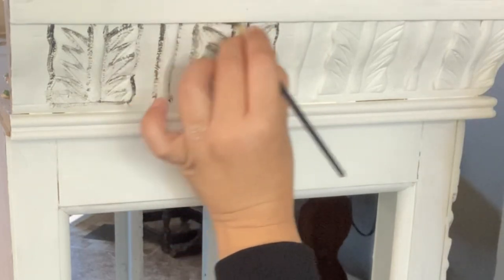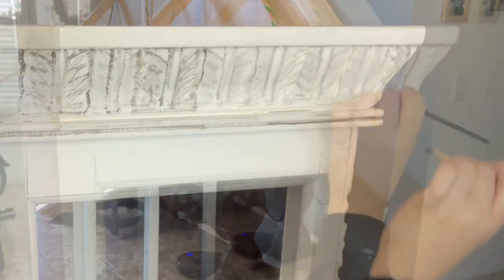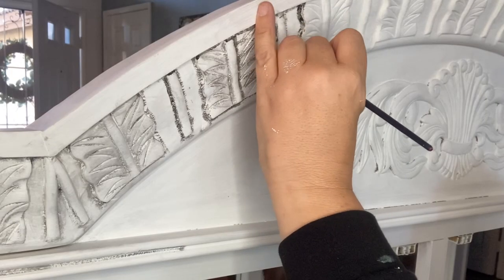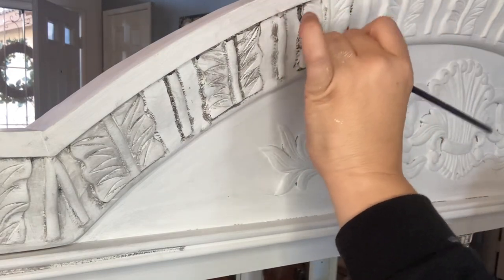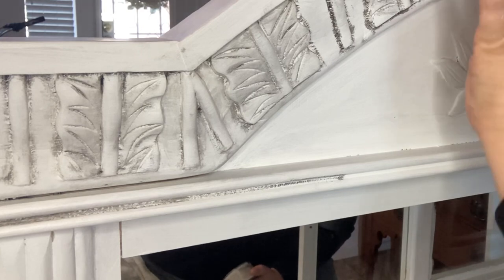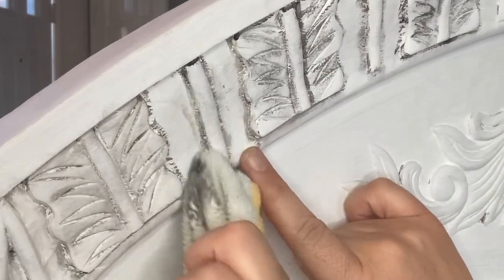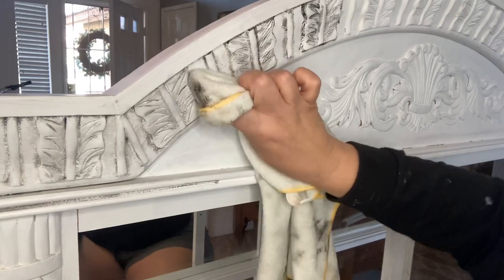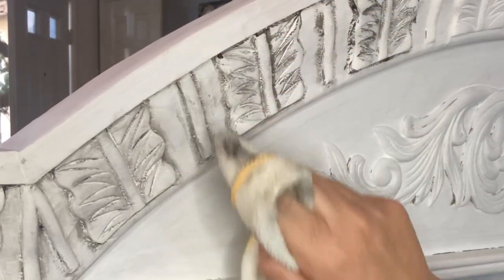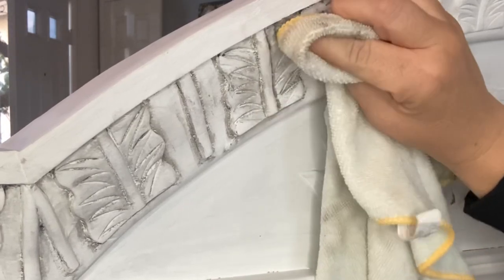Using this tiny little brush really gets down into those edges, and when I buff it back it gives a look of almost aged stone — I think it's really pretty. What do you guys think of this technique? Here's a small section I've completed — I've already wiped the black wax back and I'm working on the next section. As I wipe it back it gives a nice soft look, softening the black wax versus strong lines if you'd just painted and left it. You can buff back as much or as little of the black wax as you want, especially because there's clear wax down first — it won't adhere to the paint. If you don't like it, just take clear wax and wipe it back more. If there's too much black wax, take a little clear wax, wipe it over, and it will help erase it and give you the uniform look you want.